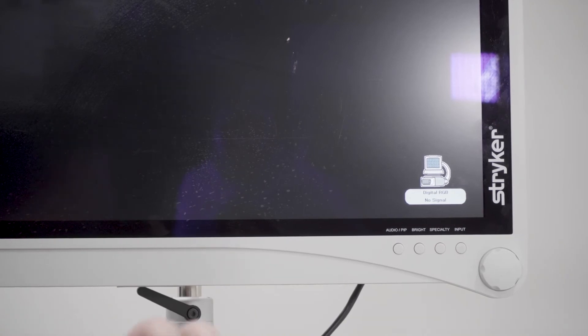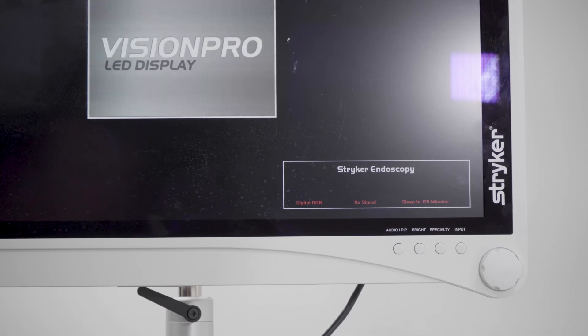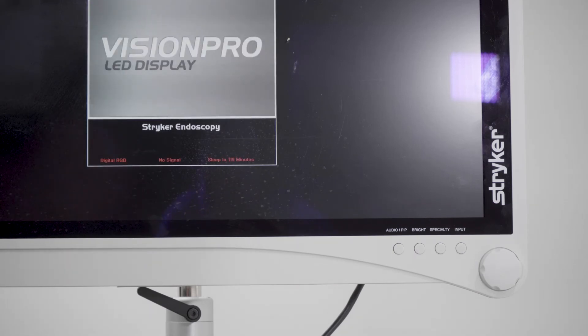If you get in a situation where you have it hooked up correctly — it's coming out of the camera box, going into your transmitter, the blue token key is registering a green dot, the monitor is registering a green dot, and you got the audio beep — so you know that it's hooked up, the one thing you want to do is look at your actual monitor and make sure it's on the correct input.